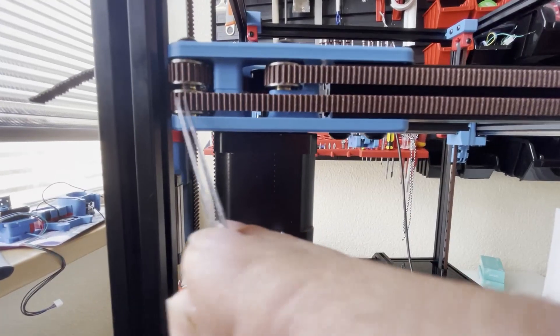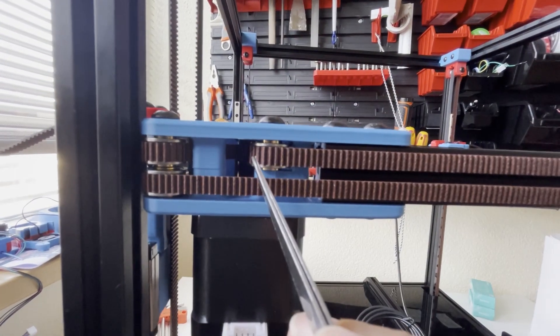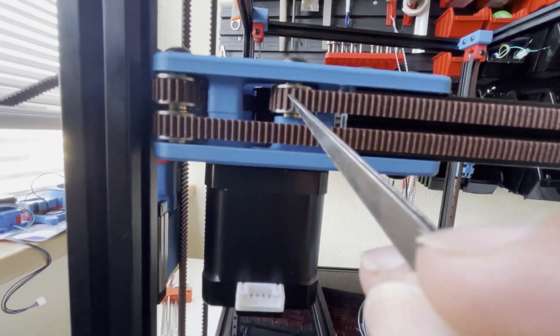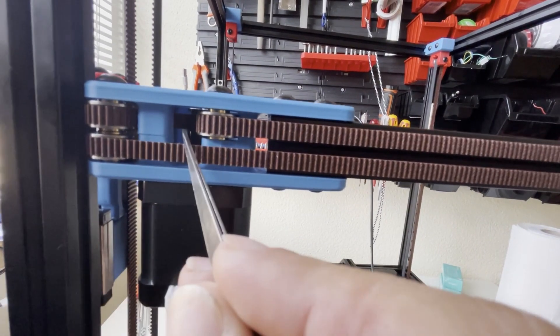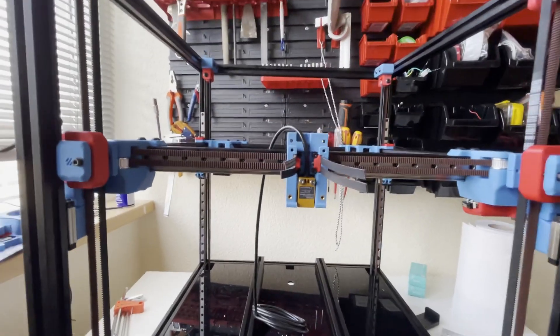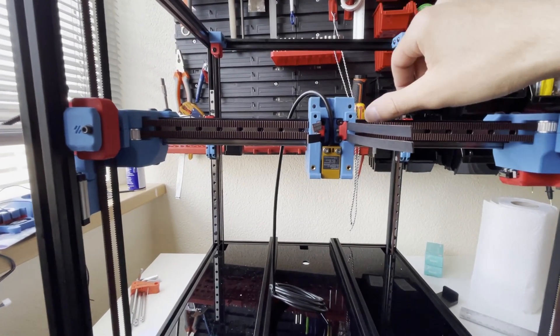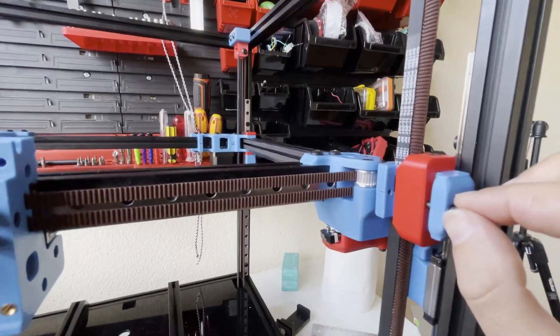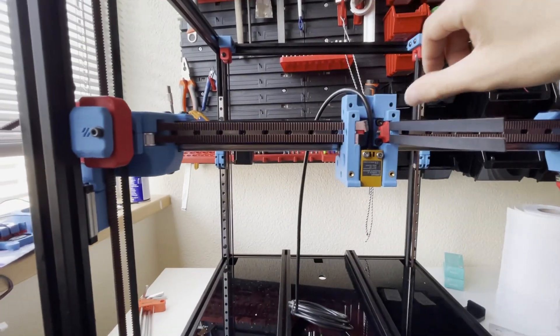This is the top view. The bottom belt is just bearing stacks. For the top belt, the back right driver: we do the same thing as the other one — for the bottom, go to idler, turn pulley, and come back to bearing. You don't want to come back through this space going around with the plastic. Make sure you have left the same tooth number in your belt so you know they are roughly equally tensioned. After running your belt, pull the gantry to the front. Without touching the belts or tool head, don't forget to put your screws back in. I made them flush with the threaded part for the bolts, so I know they are roughly tensioned the same.